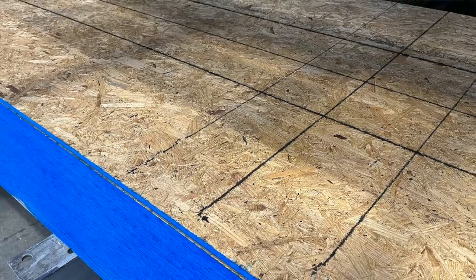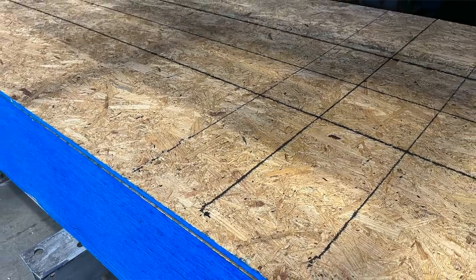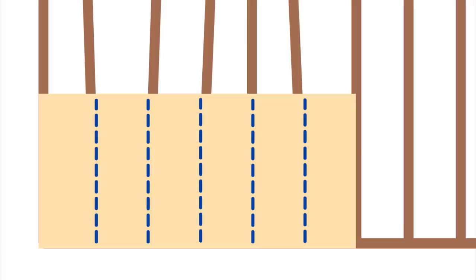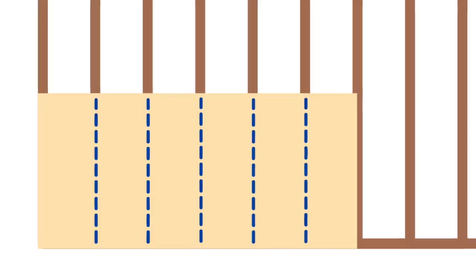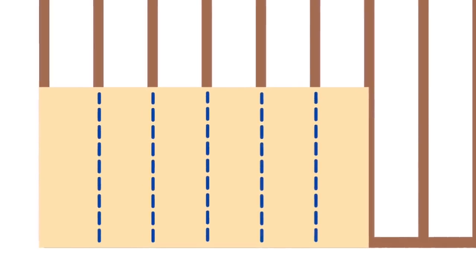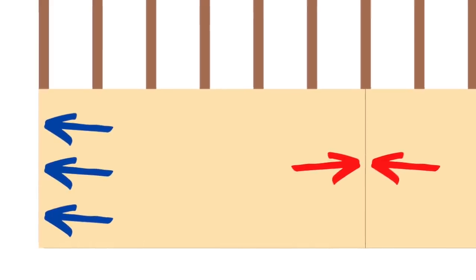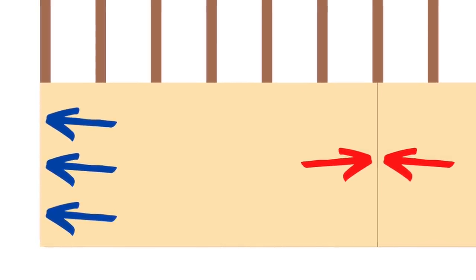Furthermore, many lumber companies are striping sheathing these days at 16-inch or 24-inch intervals relative to the factory edge. This lets us line up interior joists, trusses, or studs exactly with these pre-marked points, quickly squaring those members up as well. And because the factory edge is so reliably square, we can butt adjacent sheets up to the first one and trust that in sequence they'll make and maintain a straight line across the structure extending from the first corner — so every subsequent sheet will be square to the initial edge.